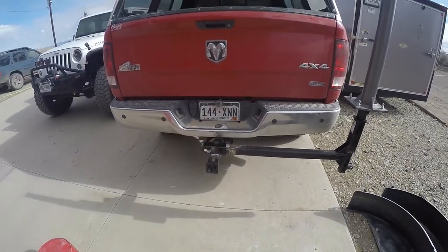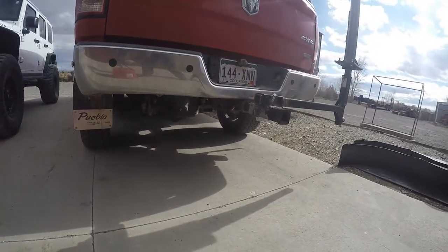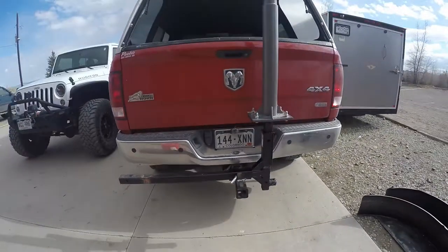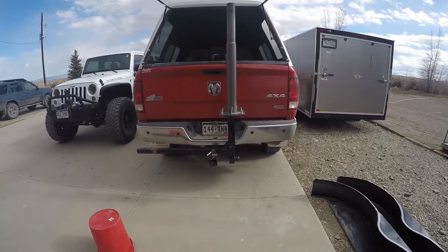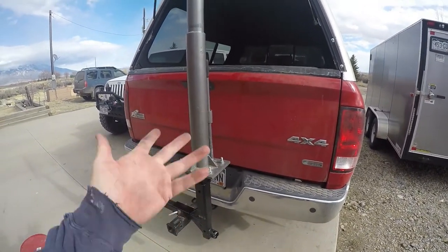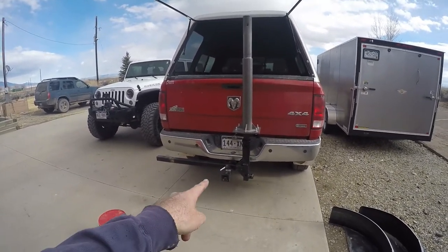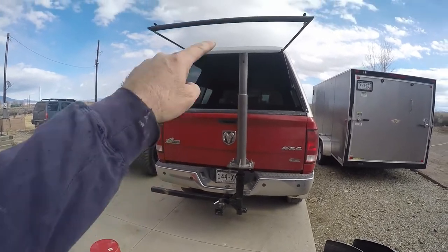It's more pieces but it's going to be easier to put together. With the crane on, hopefully it'll ride okay like that. The only drawback is if I'm loading eight-foot logs into the bed of the truck and I have the tailgate down, that's not going to work — I'll have to take it down and just throw it in the back of the truck. But for loading something here at the house and taking it somewhere and unloading it, that'll be nice because I can just slide the crane over, it hits the dead stop, slide the pin in, put a little R-pin on the backside, tie down the boom, and drive away.